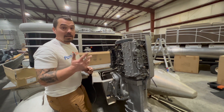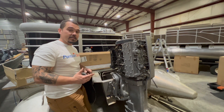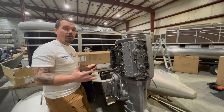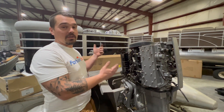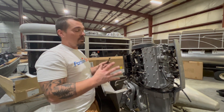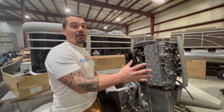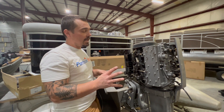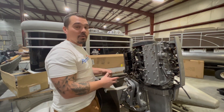Something to keep in mind that I think is going to help a lot of folks: your ignition harness for your engine should be, and typically is, completely separate from the harness of wires that control all of your electronics — your stereo. It typically is on a separate lead to the battery for your accessory stuff, your dash panel switches, all of that. If you're redoing your boat top to bottom and replacing your electrical, rip all of that accessory harness out — everything that connects to lights, speakers, whatever. Keep the ignition harness in great shape so you can run it back through and reuse it.